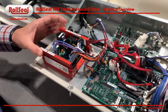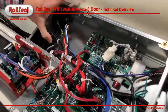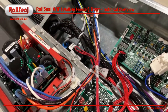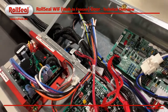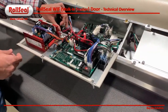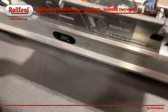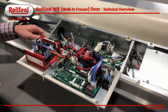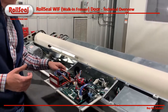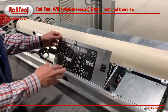So to start, we've got our VFD that we're using to control the speed of the motor. We've got a home sensor, which can be seen here. This home sensor is what's going to allow us to know what the open position of the door is — it will automatically go back up to this position so it knows it's at its upper limit. We also have a motion sensor that comes out of the top bar of the door. It can be used for activation, as a safety to auto-reverse if it senses motion, or both, based on the programmable setting shown on the controller.